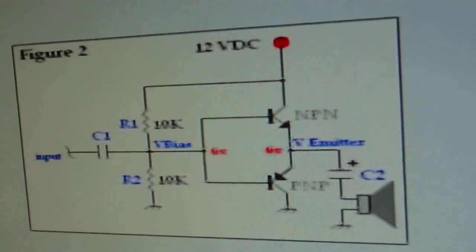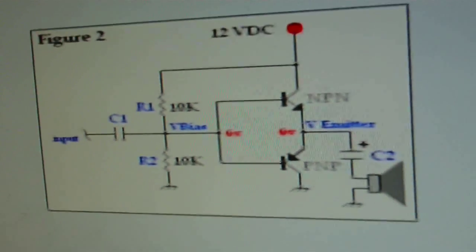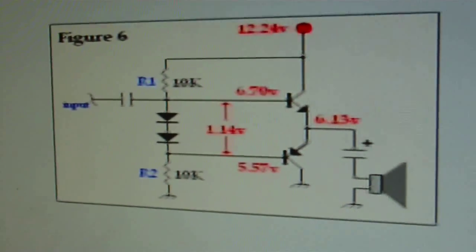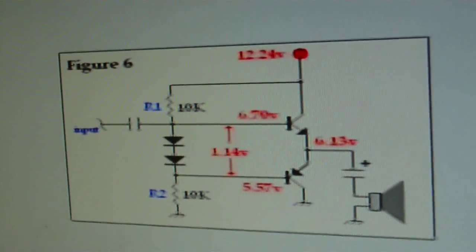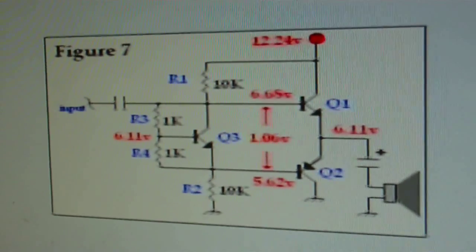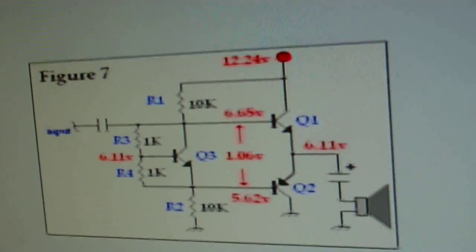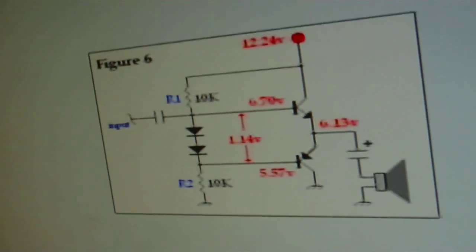But there's a little bit of distortion with that one, so I'm going to build it just out of curiosity to see what kind of sound quality it gives. And when I actually build it for real, with those two diodes there which help bias the transistors better, that should give me a good enough sound. But if it doesn't, I'll build this, which has an additional transistor there — Q3 — which is the ideal way to bias it. I think this design will work pretty much okay.